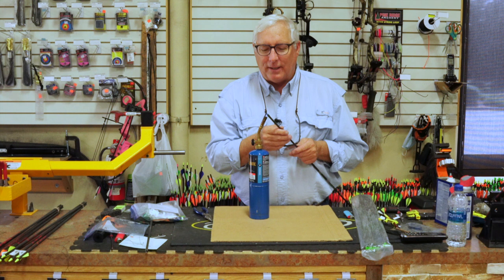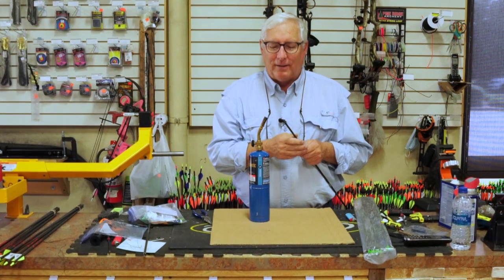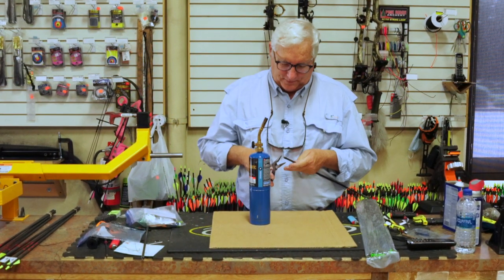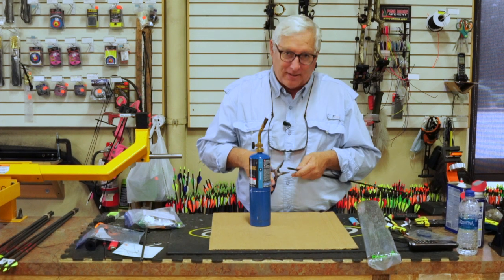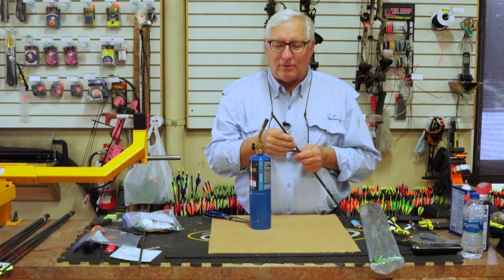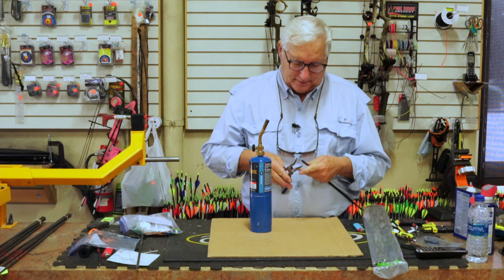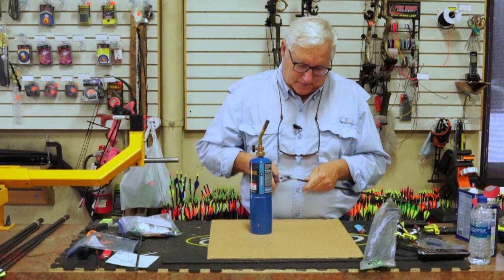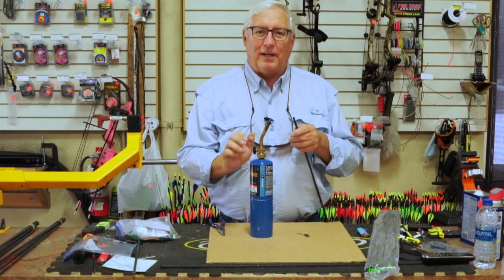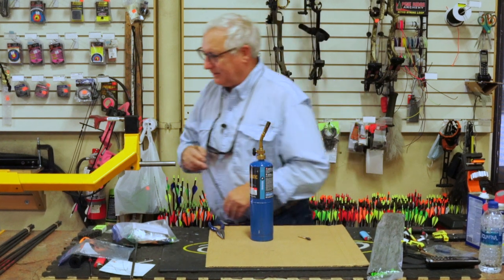So we're going to heat it up again. That's it, wait. I can usually feel it starting to get warm here, which is good. Another one, so we're going to put our pliers on it, see what we get. Not ready yet. Wait a little bit, let the heat travel down. We don't want to get it too hot. We'll try it again here. Got our tip out. We can set it down where it stays clean. Turn off the flame, and now we can go cut this arrow and get it ready for another flight test.